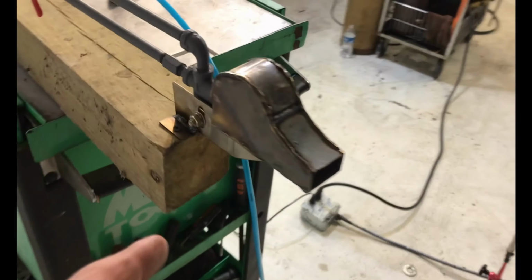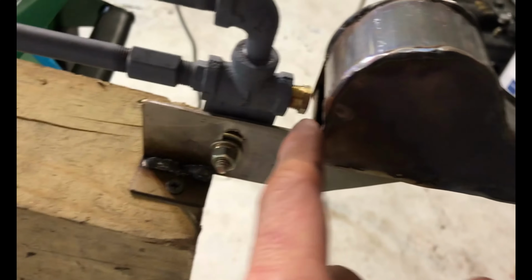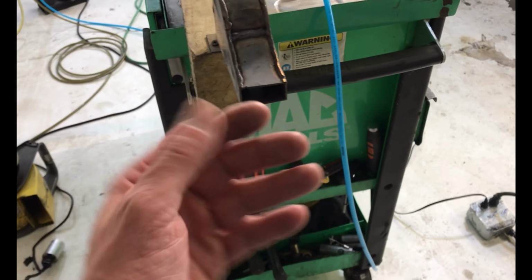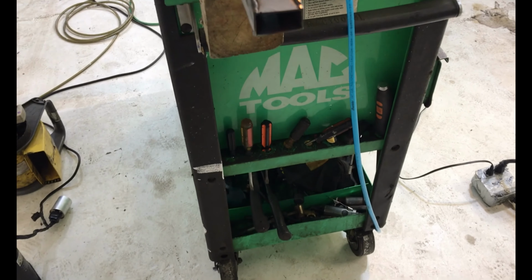We won't even be able to see the air gap, probably. You can kind of see it. You couldn't slide a human hair in between that oil pan and that annular air shroud. It's very thin. And we were getting up to about 25 psi. Now when you hold your hand up to it, it's a fairly decent airflow.